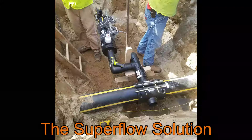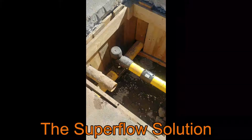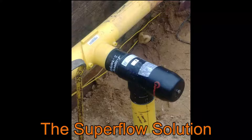The Superflow solves many of the drawbacks inherent to the other methods outlined. It is a gas-free installation at high pressure on large diameter PE mains without squeezing off or disrupting the gas flow, all done in a standard excavation using current approved branch saddle fittings, making it easily compatible with any company's pipeline system.